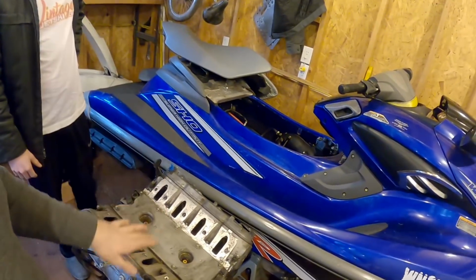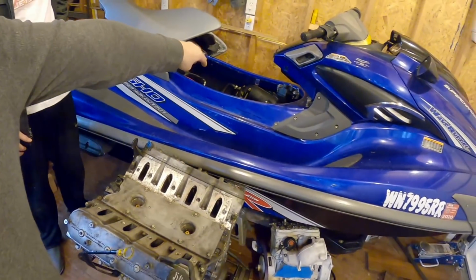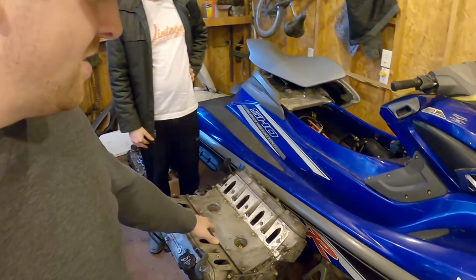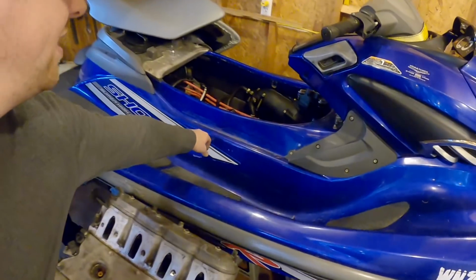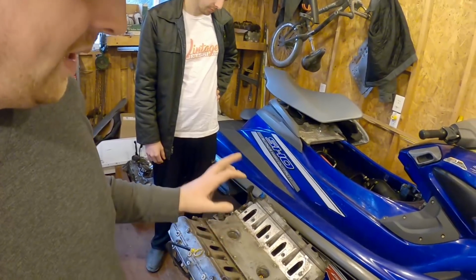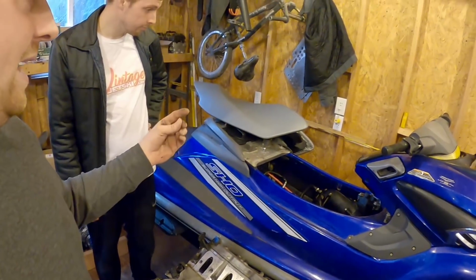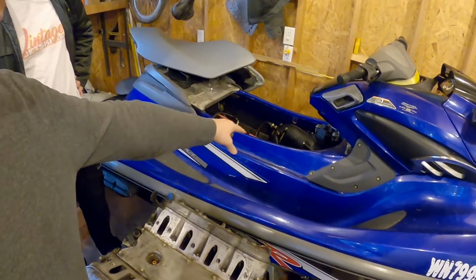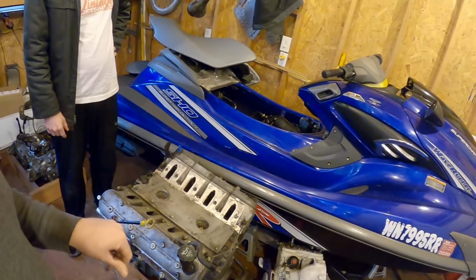And I will tell you right now, guys, this engine does not fit in the hole provided there. Essentially, we could either pull the heads off and install them when it's installed, but even then, it's not wide enough up top here to clear the heads. Just shy of wide enough. We're going to get into measurements later, but that's just an overview. So it really looks like the engine area is going to have to be widened, which means some custom fiberglass work on the hull itself.